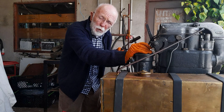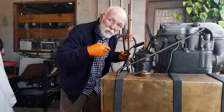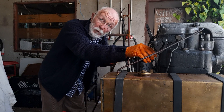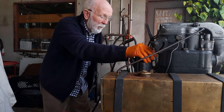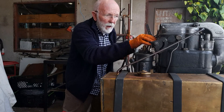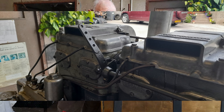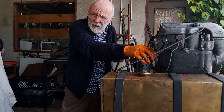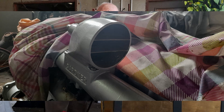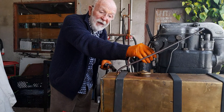It's important not to give them too much heat, because what happens is the flame consumes all the oxygen in the air and there's just not enough left over for the engine to make use of. It's not really a problem on this 4LW because there are, in effect, two input ports, so it's easier here. But if you had a 6LXB or 6LW or something with a single air input port, it is easier to give them too much flame and they'll not start.